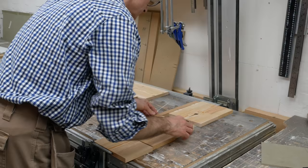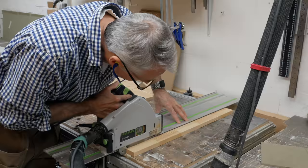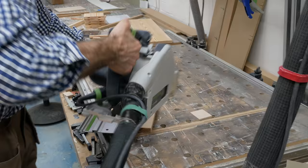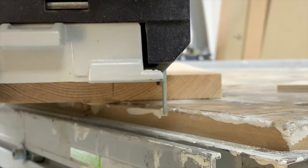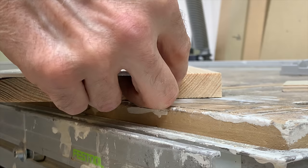And with all the mortises complete, I'm cutting the shelves back to the correct depth on the MFT, then cutting the groove in the carcass to take the 6mm birch ply back, making three passes to roughly half depth, and checking that the ply fits.